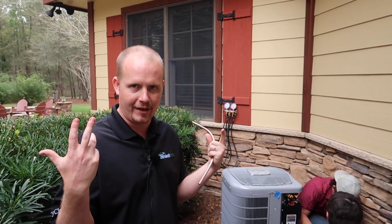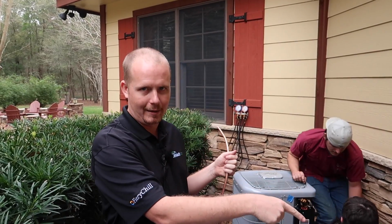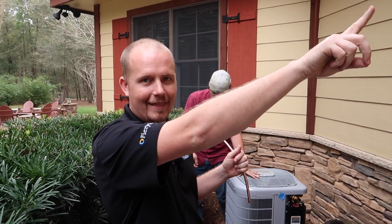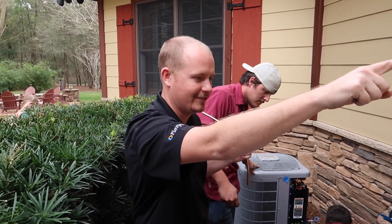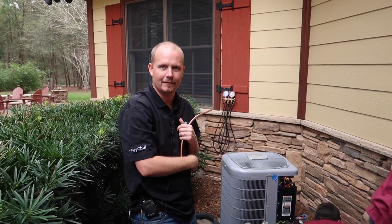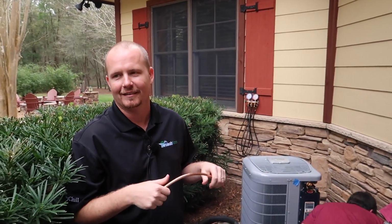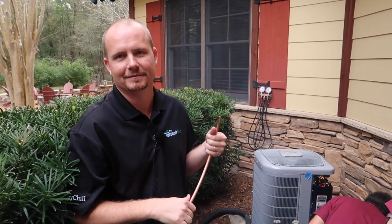Most people think that the cold pipe is pumping cold inside, and then it's making it cold in there, and then it's sucking hot back out the small pipe. The way I envision it, there's a fan in there, and it blows on the cold coil, which then blows cold air in. Right. Correct, and that's completely incorrect. That's what everybody thinks. In order to understand it, you have to start by understanding that there is no such thing as cold. Cold is fake. It's just heat, and we're moving heat.